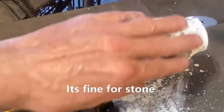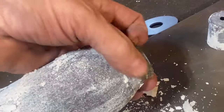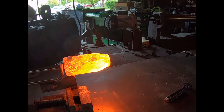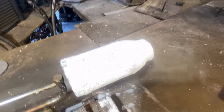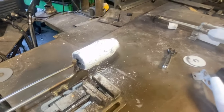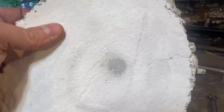This was not sandblasted, so I'm half tempted to sandblast this and do a sandblast test, because it does stick good in some spots. The coating did survive the temperature excursion — it's the cool-down that's brutal on this particular batch. This blend only works one time on thin metal that gets really hot. But it's just fine for stone; it does not seem to have any problems, because it's the cool-down that's getting this stuff, and stone doesn't contract much when it cools down.